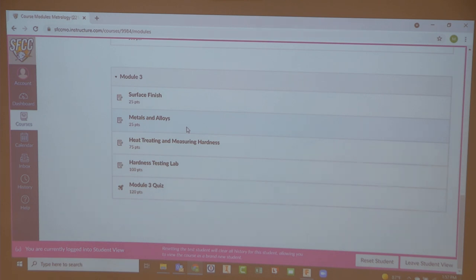So almost 59. Is that hard or not? Yes, it's hard. Super hard. It's hard enough that if it were to be used in a functional die or punch system, I wouldn't be surprised to see it not last as long as something that is about 56, 57. 56, 57 is not quite as hard, but it's got a little bit more longevity to it.